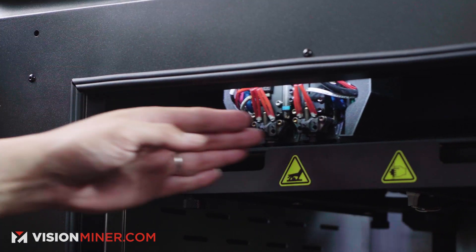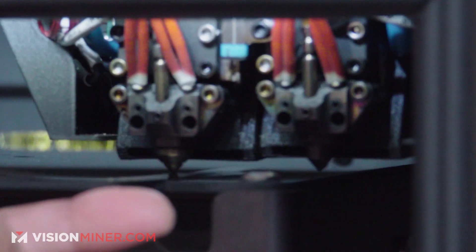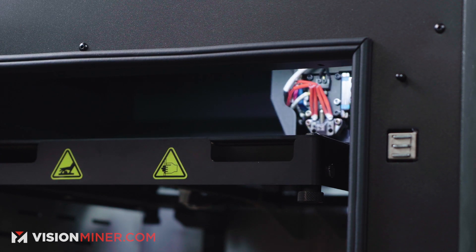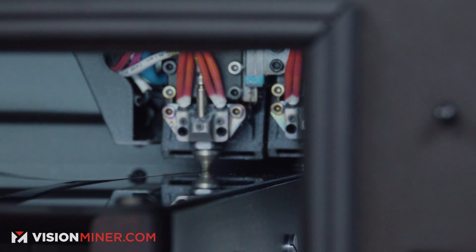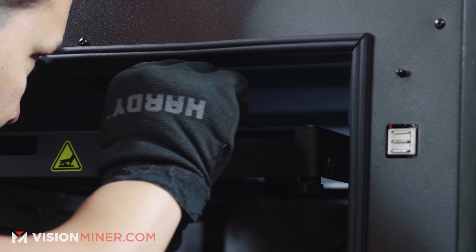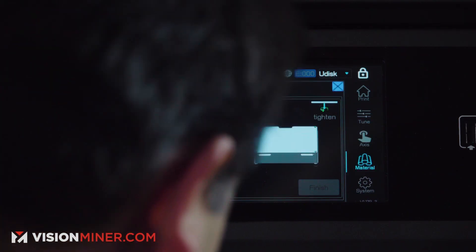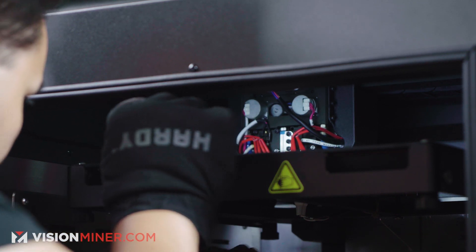Press next. Now you'll move to the bottom right — same nozzle, the left nozzle. Feels good. Next. It's going to move back to the right. Same thing. That feels good. When you're doing the leveling, you don't want any filament to be in there because if there's filament in there, it's going to gunk up your nozzle and make it hard to level.